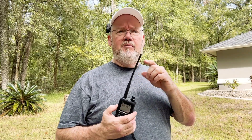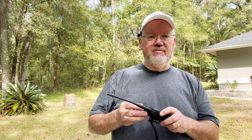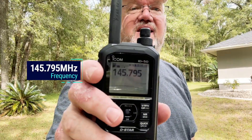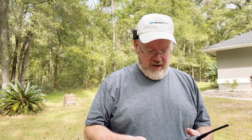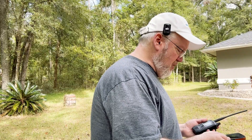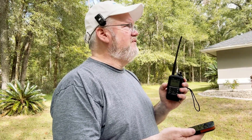There's still an opportunity to potentially get one more image if the pass works out. So we're going to hang out for two minutes. It stopped right at 5:35 on the recording clock. I'll fire up the squelch again and be ready to make a Doppler adjustment to go to 145.795 for the descending pass. Checking the ISS Above app — it's already descending at 34 degrees. I've got about one minute until the next transmission starts, so we may pick up a partial second image.